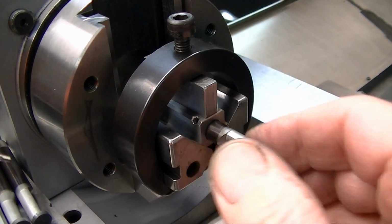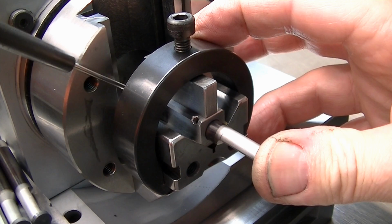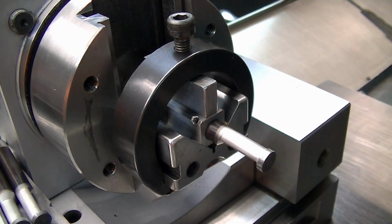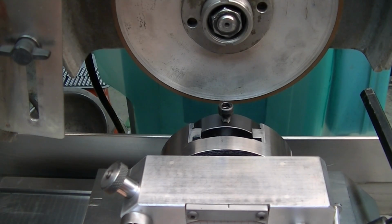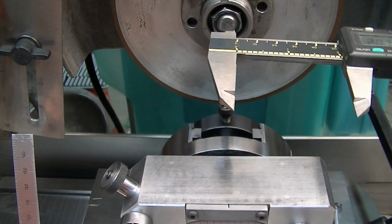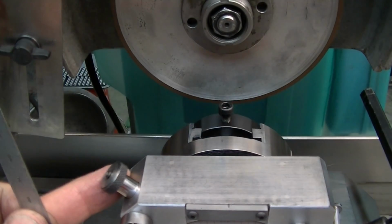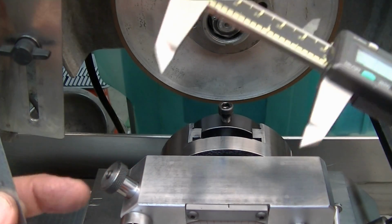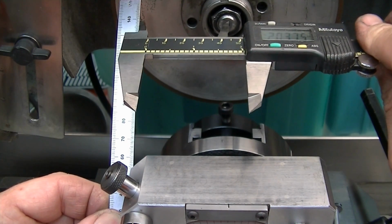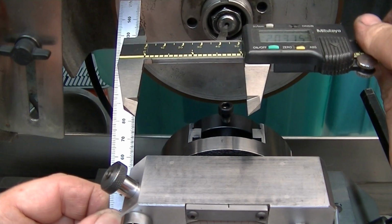Now we're going to install our piece, find our slot, axial pressure, snug the set screws. We're going to put a diamond wheel on, and we're going to grind these. Since I'm grinding a cylindrical surface and I need to take these in and out, I'm going to set a table stop, so when I come in here, the grinding wheel center line is right over the punch grinder center line. So I've taken half the width of this, which is 2.0375, and I hold my scale against the side of the head here, and I just move until I'm visually saying, okay, I'm darn close.